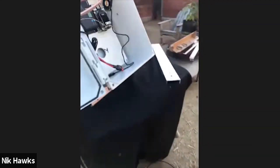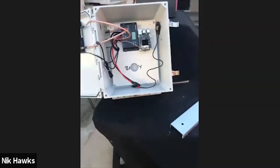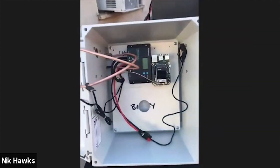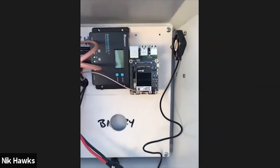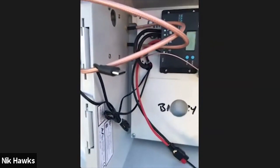The super cool thing for Nick was seeing how small the batteries are — incredible. A lot of the problems with the enclosure came from realizing how small the battery was and that he could actually fit it inside versus putting it in a separate box. Once everything goes in, the box will be pretty packed. It's DC to DC — no AC at all. The CradlePoint runs off 12V, the charge controller puts out 12V, and the only thing that needs anything different is the Pi, which needs 5V via a 12-to-5 converter on the back of the board.